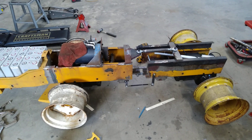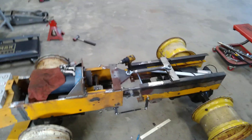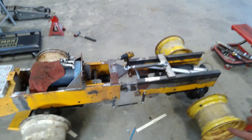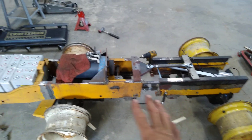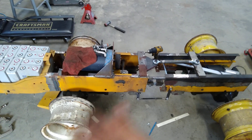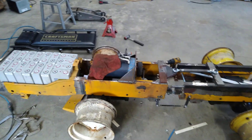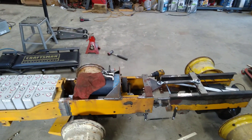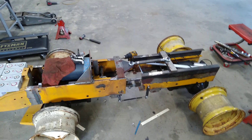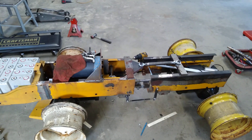My steering of this is what the problem is — how do you turn this thing? I'm going to have a seat back yonder and a steering wheel, so I'll actually be sitting over the back wheels. A lot of these articulating tractors that people make — they'll sit over the front wheels and they almost unanimously use hydraulic steering, because they all use engines and the engines have a hydraulic pump on it anyway, so they just take some of that hydraulic pressure and put it into a steering ram. I don't have that luxury.